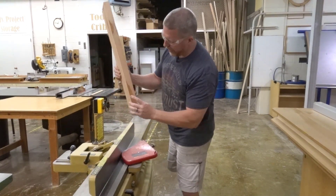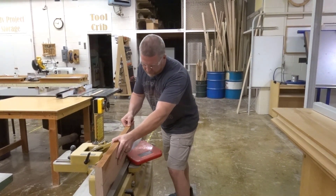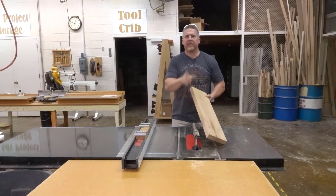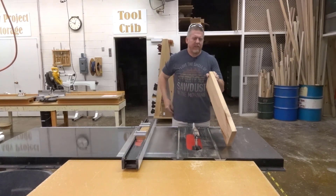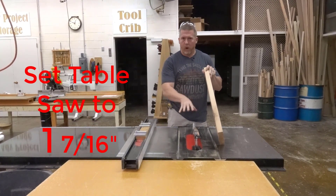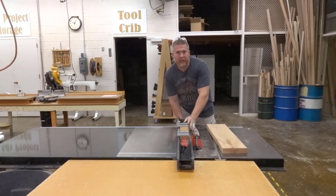I got most of it — there's a little bit left. Now we come here to the table saw, and what we're going to do is cut strips so that they're the same thickness as they are width. Six-quarter lumber is about an inch and a half thick, but when it's milled down it actually comes out a sixteenth shy of that — so we're actually at one and seven-sixteenths, which is very common. So we need to set the fence to one and seven-sixteenths, and we can just do that on the tape measure on the table itself.